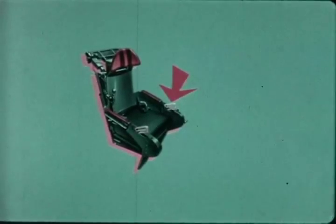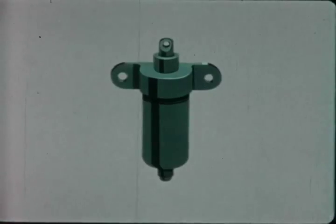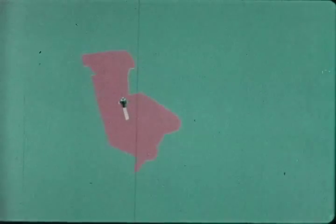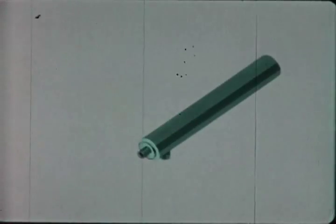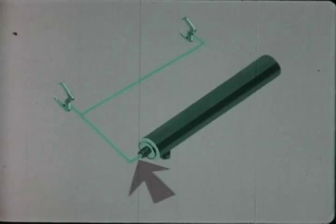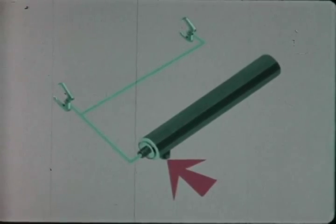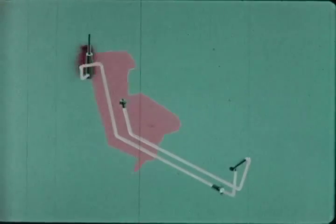When the pilot lifts either ejection control handle or pulls up the canopy jettison knob, mechanical linkage pulls the pin that fires the first ballistic charge in the canopy ballistic system. This charge is called an M3 initiator. Firing of the initiator expels gas through the ballistic system hose to fire an M3 thruster. Now, two things happen when the ballistic charge in the thruster is fired. The plunger is driven out to disengage the canopy latches, and at the end of plunger travel, the gases are ported through this outlet into the ballistic system hose to fire the M5 initiator. Firing of this initiator, in turn, fires the ballistic charge in the canopy remover.